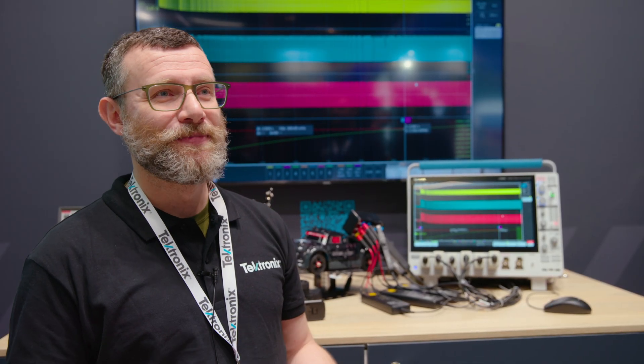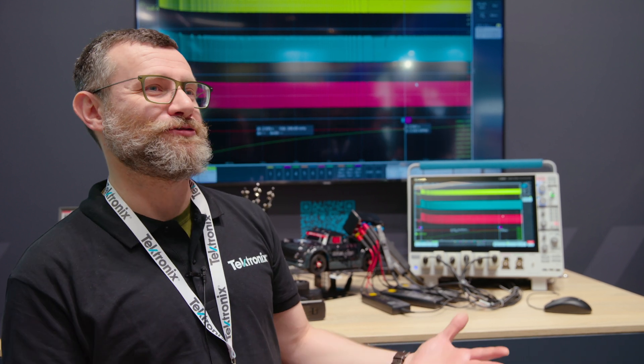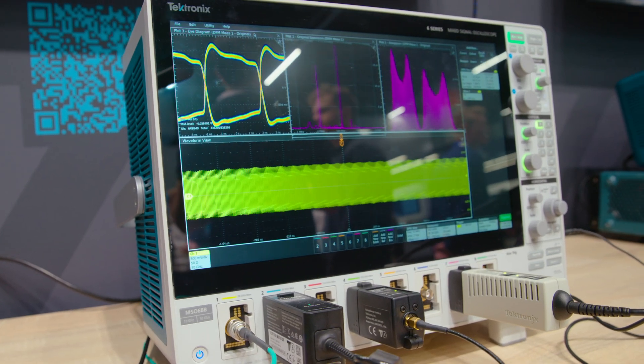We are going a little bit into the philosophy of metrology here, because whenever you probe something you actually modify it. It doesn't really matter if your probe is gentle with the signal and doesn't load it too much — it really depends on the context. You are anyway modifying the topology of your circuit because you're plugging something onto it, so you're not seeing what you would expect without a probe connected. That's the first thing an engineer always needs to remember.